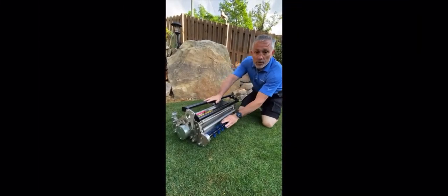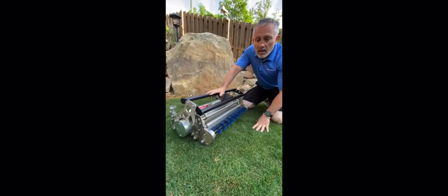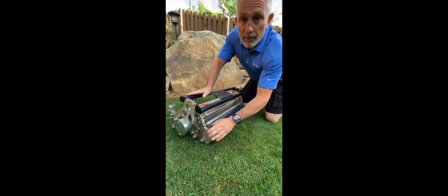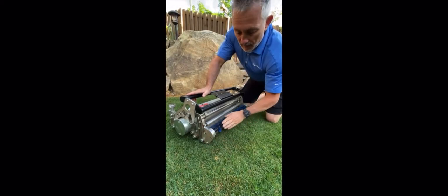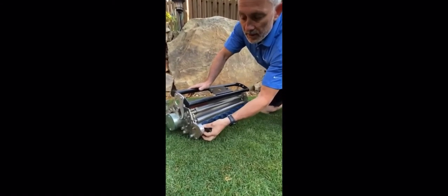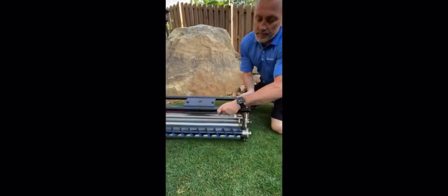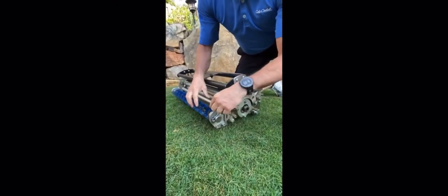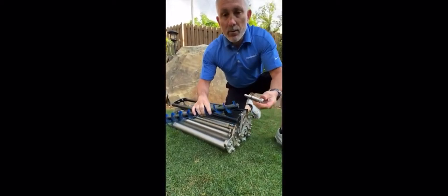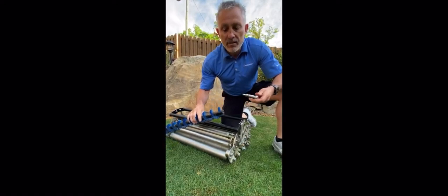I want to tell you about the rear roller power brush, which is an option you can fit to your chassis. It's a fantastic tool for keeping the rear roller clean of debris. It has a sealed gearbox and is ground driven off the rear roller — not drawing any extra power from the machine. It has one grease fitting on the side. There is an eccentric here which allows you to adjust the aggressiveness of the brush against the reel, and on the other side a slotted bolt for further physical adjustment. Quick release with a pin and R-clip — pull the pin and the brush is out, easy to service. A really simple, straightforward, great addition to the chassis.